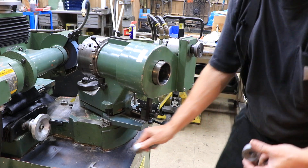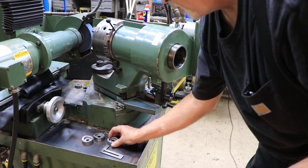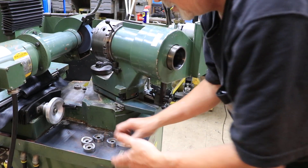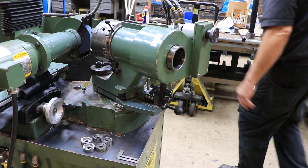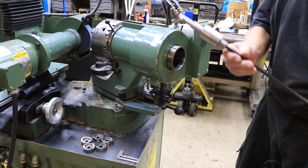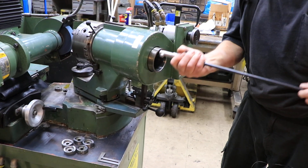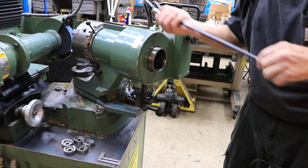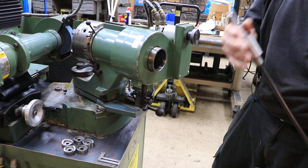We have our different cams here. Take the one that's on there off and you put these on. The machine comes with a manual that explains all this stuff. This is a dressing tool — you put this down through the bore and tighten your chuck up onto it. Then you can turn it in such a way to put certain relief or angles, or just dress the grinding wheel.